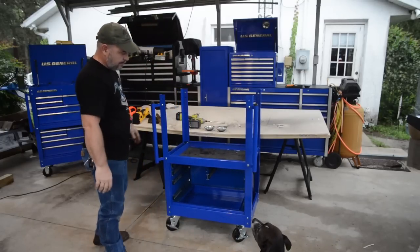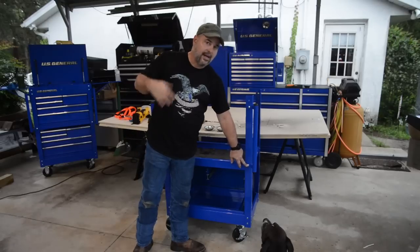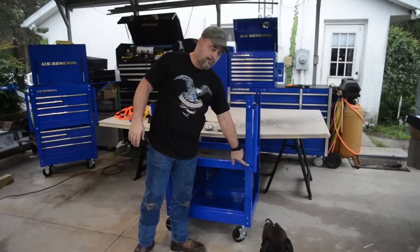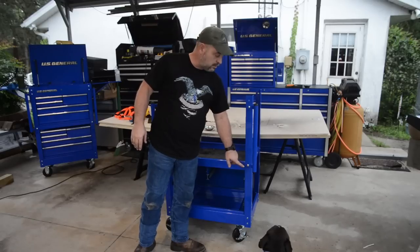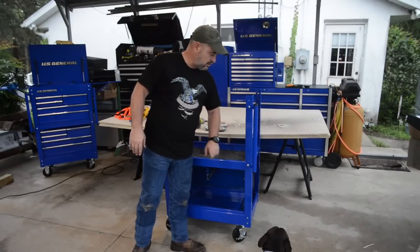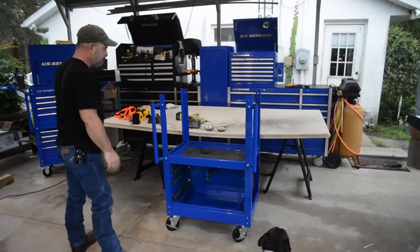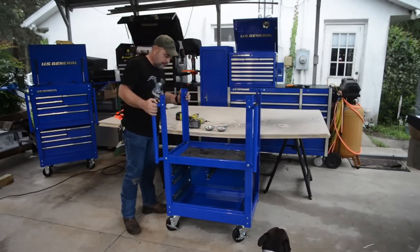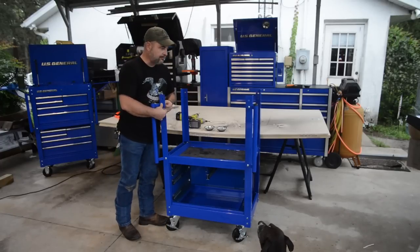Alright, most of that's done. So I told you earlier, use the bolts that fit here. I struggled. I had already purchased 5/16 carriage bolts by inch and a quarter to get that extra length. It's the only two places you need those. Use them. We'll save the fight. Alright, these bolts come back out.